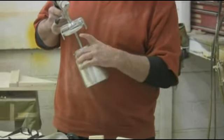Now what I've got here, what I did is I've scuffed all of this. I went ahead and put my top and my bottom in because I can get in here to spray it, and I put it together so you could see that. Now what I did here was I just ripped a little bit of MDF and stuck a little finishing nail in here, and I'll pull it right out when I'm done, just to cover my dados, because I don't want a bunch of paint buildup in there because that could affect my fit.